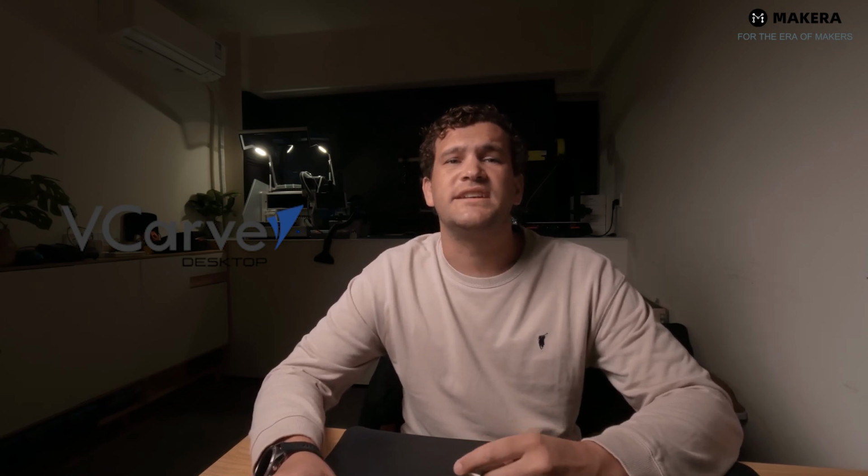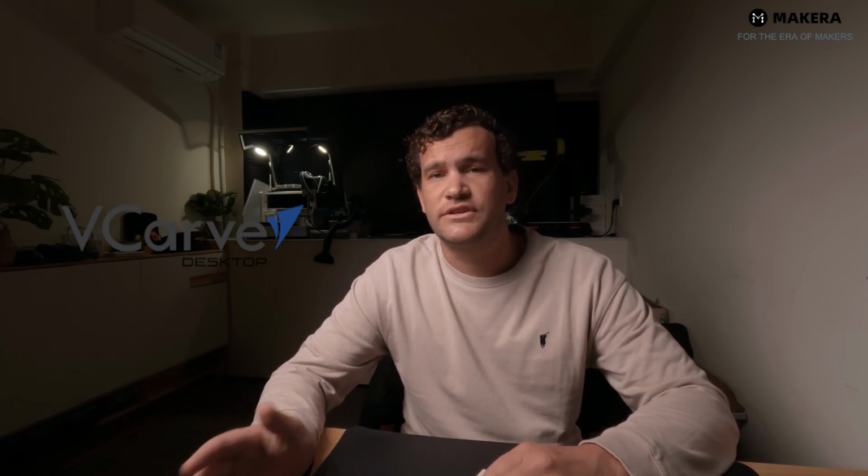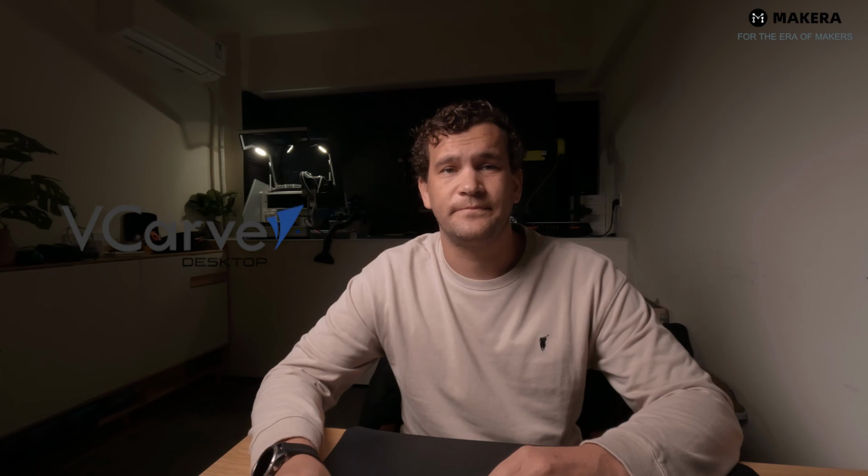Vcarve Desktop Edition is designed for small CNC machines aimed at hobby and non-production environments. The software is more craft-based and focuses a bit more on relief milling. It does support all the functions that you need to create complex 2D and 3D parts, and also supports cutting in the 4th axis. I think that deserves its own video. The software has a design library that includes thousands of artworks and also gives you features to edit them and even create your own. So you can basically use the software to do design as well.